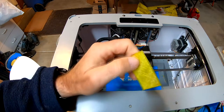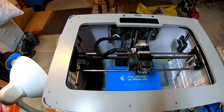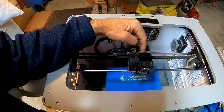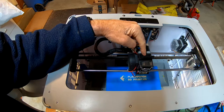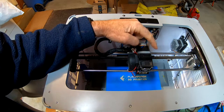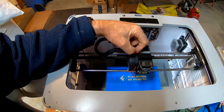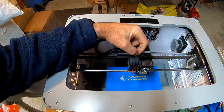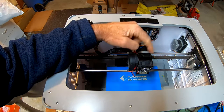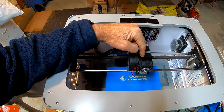I've been having some printing problems lately. I'm not sure they're all related to the nozzle, but I figured it would be instructive to take the nozzle apart again. We replaced it about a month ago to see what's going on inside and see if that has anything to do with our issues. I've also got some cleaning filament, which I just learned about recently, for when you change materials. I've been switching back between PLA and PETG, and I'm wondering if that's causing the problem.